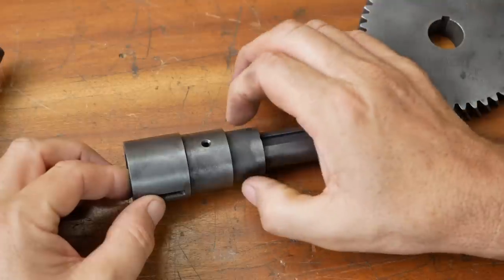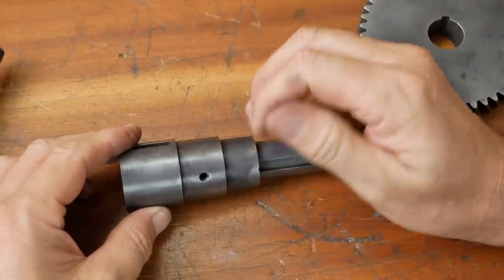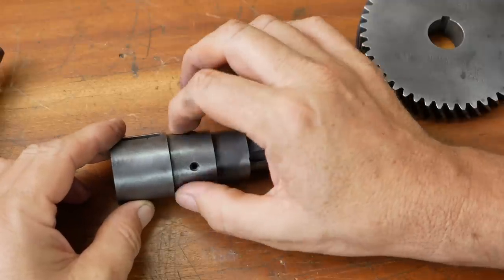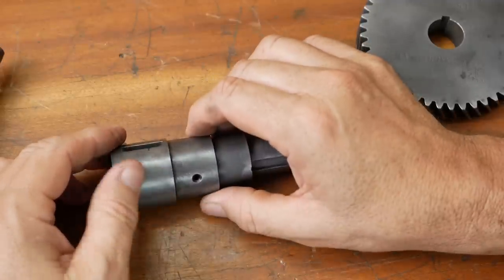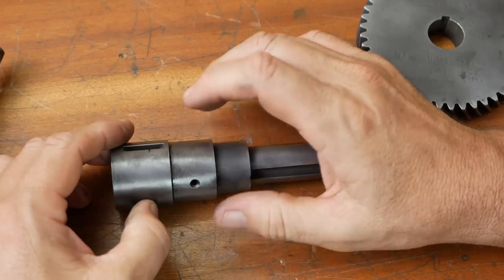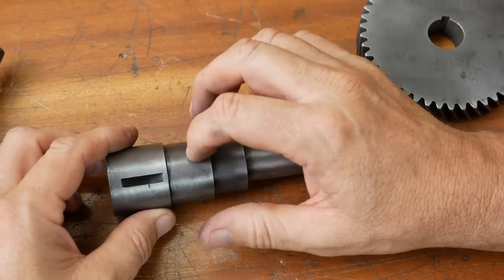Yeah, this shaft, once again, this bearing journal, I'll have to be careful not to take it undersize, and if I can't avoid it, it's going to need Loctite bearing retention. These two both need to be cleaned up to a high polished finish because they're plain bearing journals. They're probably not quite as critical dimensionally. There were quite wide tolerances on those.